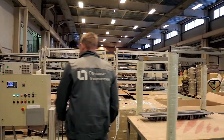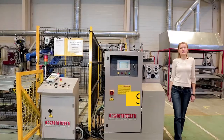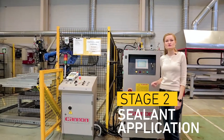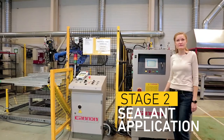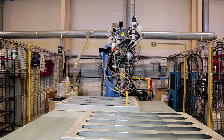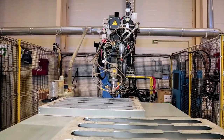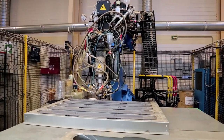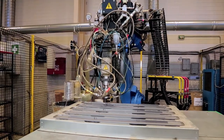The process is fully automated. The second stage is the direct application of the sealant. We use a robotic complex Canon AFROS B1 to do this. This machine makes it possible to fill the lamp housing with a two-component sealant. Mixing of two-component materials is automatic.